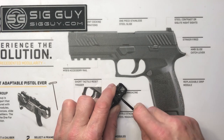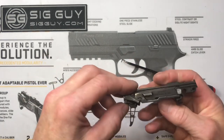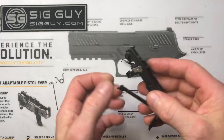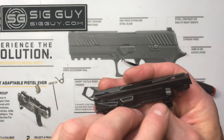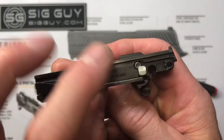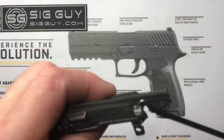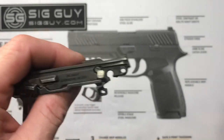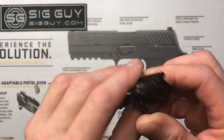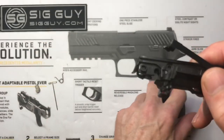We're going to get our trigger bar spring out of here. And then we're going to remove our trigger bar real quick. Let our disconnector fall out of there. So before, you pull this pin out just a little bit, remember, till the low step was actually even with the side of your frame, when you can go like this and feel it. We don't care about that anymore. We're going to take this right out of there, okay? So my disconnector's out.